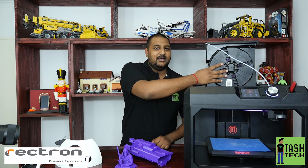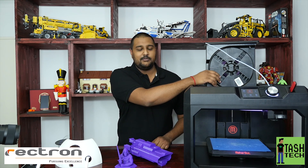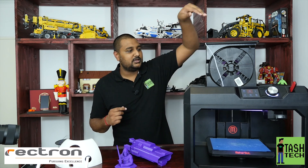The second issue was the filament jam. I knew something was wrong because I had a very slapdash filament spool setup - basically a galvanized tubing cage setup I use for quick test prints. I disconnected the PTFE tube and fed the filament directly in, and it ran for about 22 hours nonstop printing parts for the Canterbury spaceship. No issues.